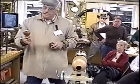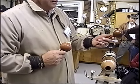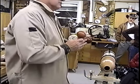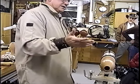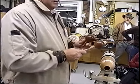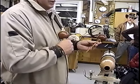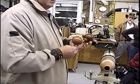okay, this one I made in '05, and this one I made in '06. The '06 is darker because I put an artificial finish on it. I used vinegar and steel wool, mixed up with steel wool, let it set for a day, and then take the water and put on that, and that darkens it. And this is cherry, and this is cherry, but this piece of cherry doesn't have this finish on it. So you get the contrast, but they're compatible as far as color matches.